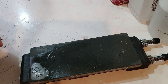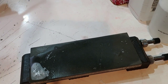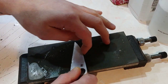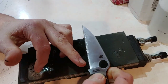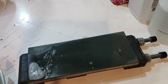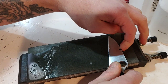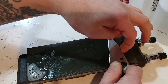I'm not too concerned about it being exact. I just want to make sure that I can repeat the angle that I start with — that's the most important thing. I'm going to pick a place on the spine of the knife where I'm going to hold my finger because this is going to go straight back and forth. Because the edge is nice and flat, or nice and straight, I don't want to change that. I want to make sure I keep it nice and flat. Even when I drag off the stone like this, I want to make sure it still stays nice and flat.